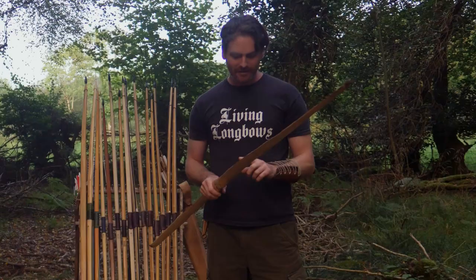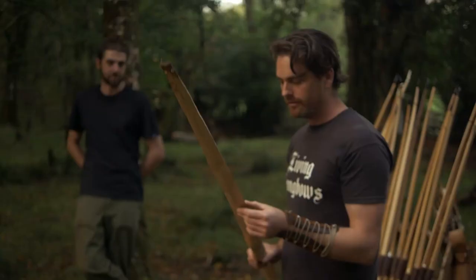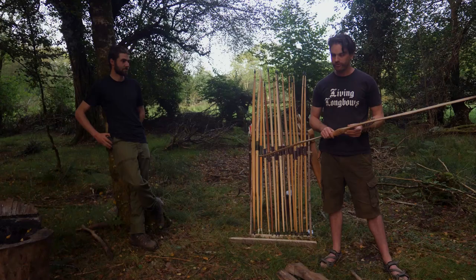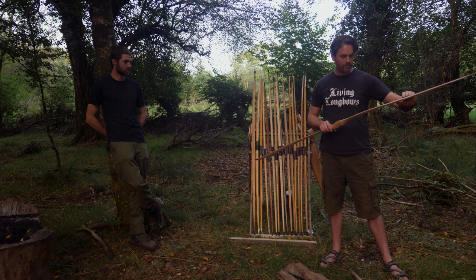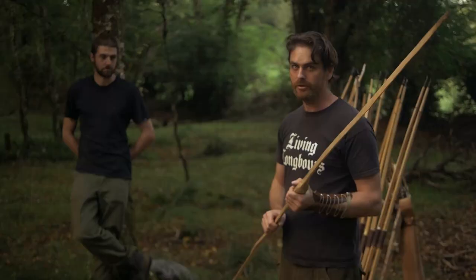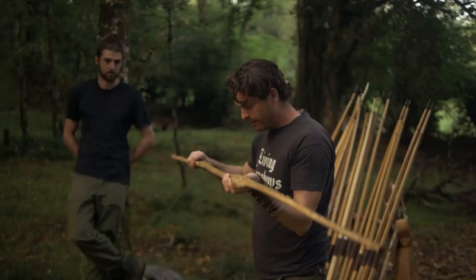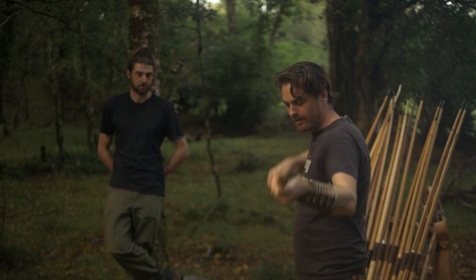There's something that's happened on this that hasn't happened on the other — the back of the bow is not chased down to one growth ring. The traditional accepted knowledge is that the back of a self bow should be one exposed annular ring. If you cut through them and violate one by slicing through it, you potentially introduce a weak spot where grain can lift up and break the bow. This one has it, and you can see the cambium layer still in evidence — good.